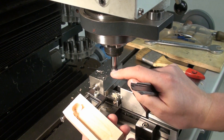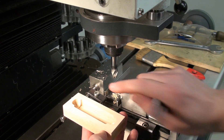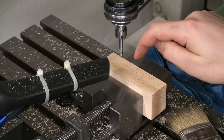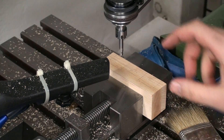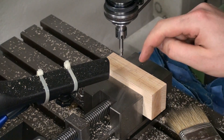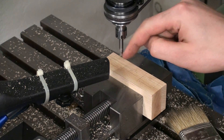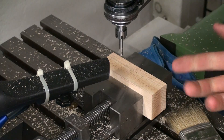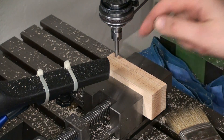I was running this end mill at 1000 RPM, and at that low speed it doesn't throw dust around all over the shop like a router would. Right now I'm cutting - how do woodworkers call it - a mortise for the hinges. I have the body of the box and the lid clamped up together in the vise, laid out the mortise for the hinges, and I'm cutting the material with the engraving machine using a square template, aligning it by the layout line.